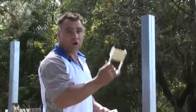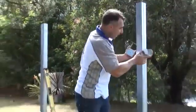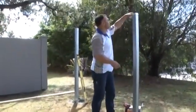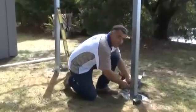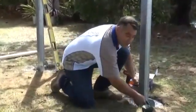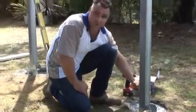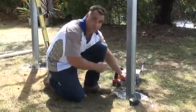When it comes to the other side, make sure you throw the other cleat on first — that will set you up for the next panel. Drop it down, this cleat goes on level from the other side, and you can adjust this side to whatever the ground level is. Remember, if you do make a mistake, you're using screws — just unscrew it, get it correct and screw it back in.